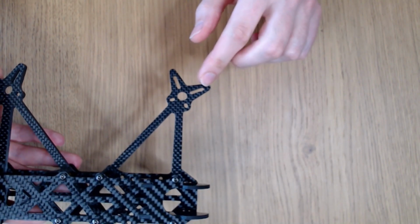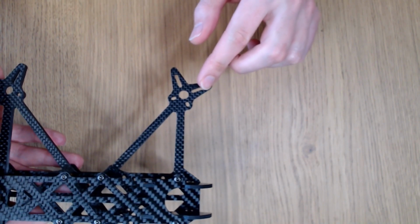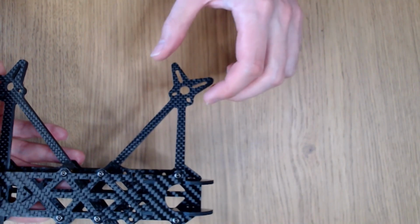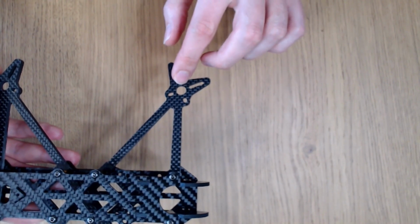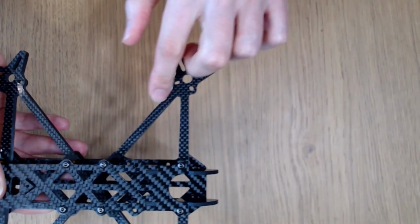And that's really important because a lot of the vibrational modes that trouble typical frame designs involve torsion of the motors left and right, or forward and backward actually, and that's simply not a problem with this frame design because of that absolutely enormous torsional stiffness that's afforded by the truss structure.